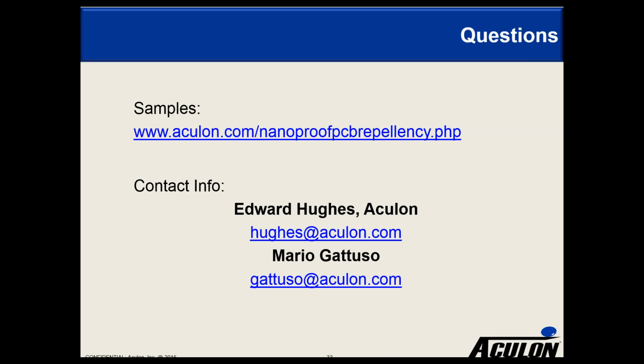Okay. How is the product cured when applied? Is it a UV, a heat cure, or is it just room temperature? Room temperature drying is what we typically do. If you want to increase cycle times on some of the more slow drying formulations, a quick cure is possible. It doesn't damage the coating. But typically we just do air drying at room temperature.